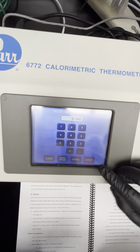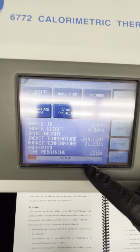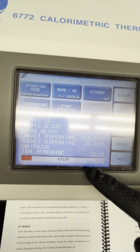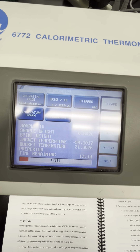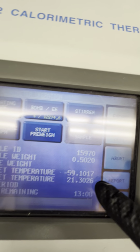For the sample weight, enter the exact weight you got off the scale — whatever you put in the calorimeter in that sample dish. For PCAM, it should be something around 0.502 grams; approximately 0.5 g is what you want. Record exactly what is on the analytical balance, then click enter. On the next screen, you'll see the runtime remaining at the bottom. For the first seven and a half minutes, the calorimeter is coming to equilibrium, and the temperature you want to record is the bucket temperature.